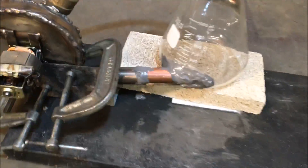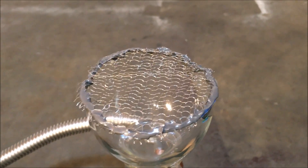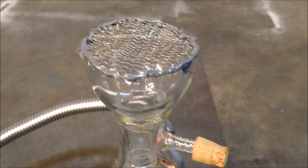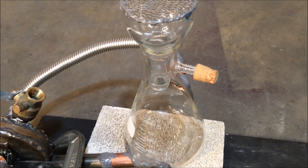Here's a quick walk-around of what we've got going on. I'm basically C-clamped to the tray here. That's some 500-degree JB Weld. There is my return line for recirculation, there is the discharge line for the cyclone, and there is the gas discharge. The reason that screen's on there is because some gases will burn very well behind a screen. I wanted to see if we get a flame down inside there, or maybe even just diffuse the gas coming up through there. I didn't want to leave it just a hole because the velocity of the gas would be so high that it would diffuse with air and reach an incombustible mixture ratio and wouldn't burn.